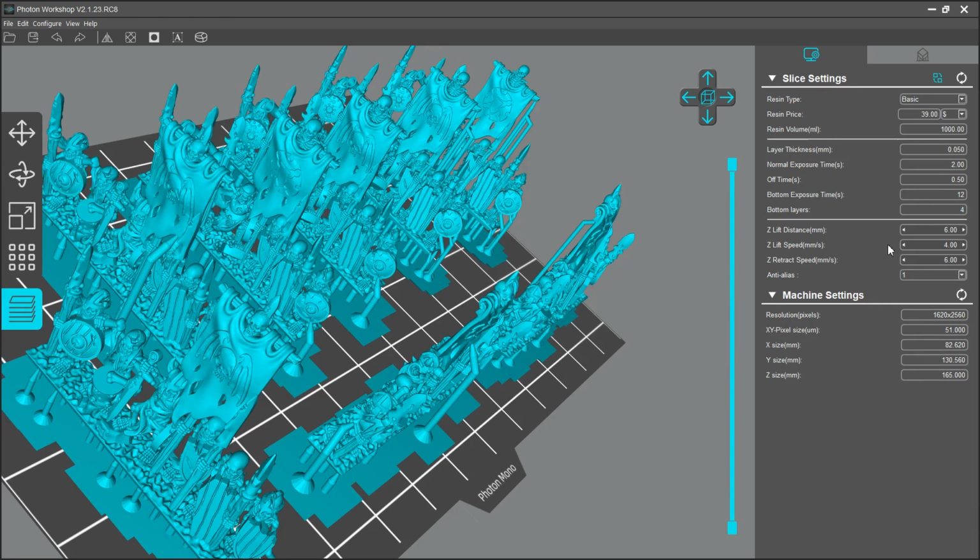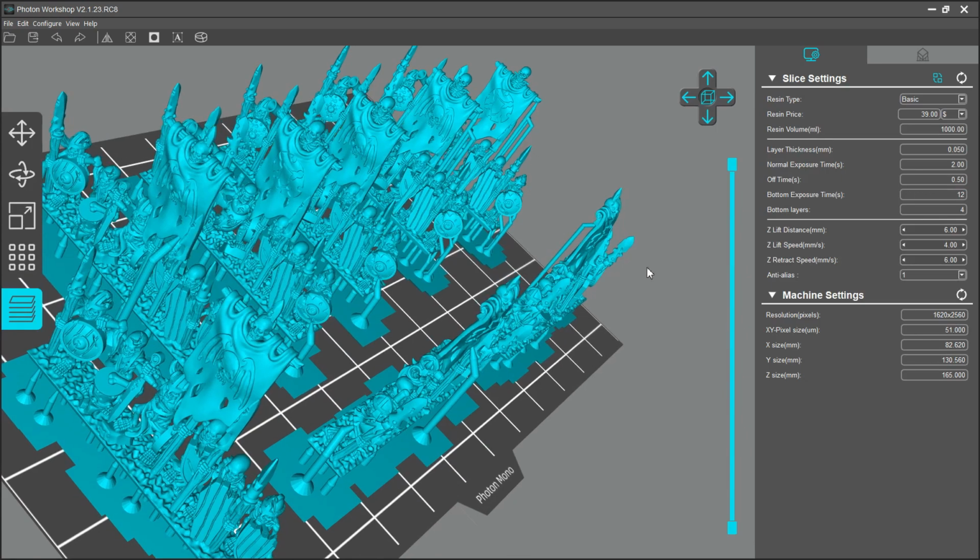This is what Mr. 3D printing man on the YouTube was saying, swearing blind, that is what you need to do. So I'm going to try it. It's going to save my bulb life, because those first layers are where all the bulb and the screen is going to wear out, because you're piling lots of heat and light into a very small time frame with not much cool down. So we'll take that down from 40 to 12. We'll change the bottom layers to 4, and the potential problem will be that stuff doesn't adhere properly to the print bed. Well, I'm having the exact opposite. If anything, it's adhering too well, and I'm having trouble getting it off. So let's see what happens. I'll print these 8 off on Monday, and we will see what happens.